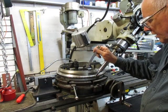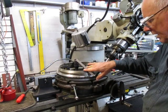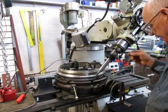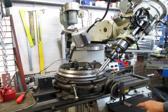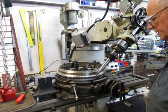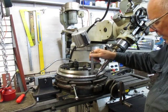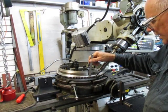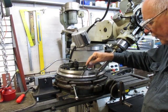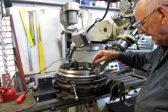What I did was I never took the ring out of the setup here. I released the detent that I'd made up, set the worm gear back into place, straightened the head and went round progressively cutting this ring down from this point here.